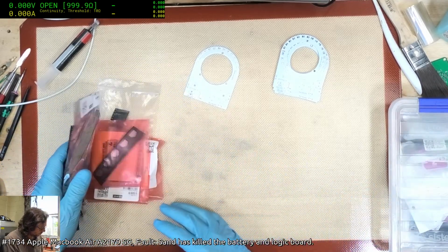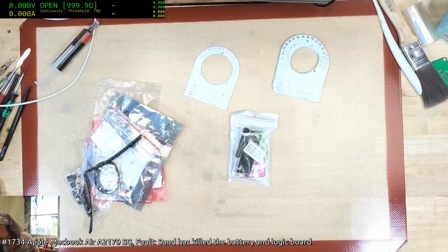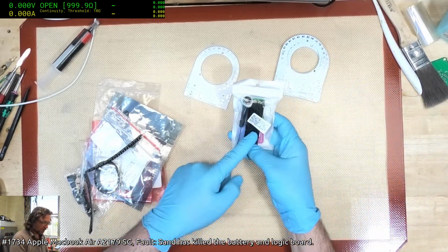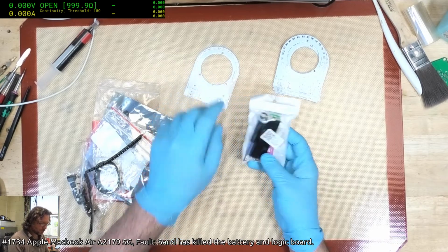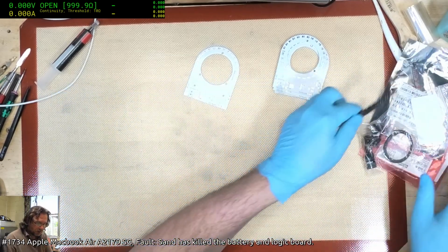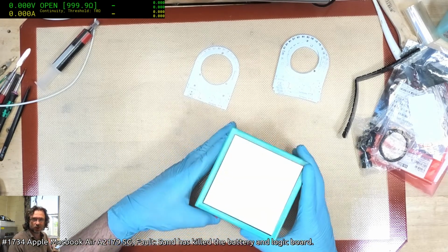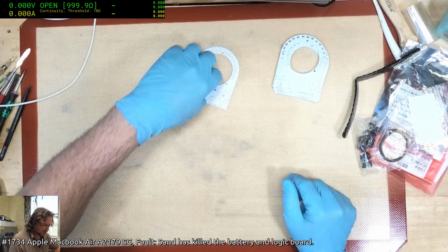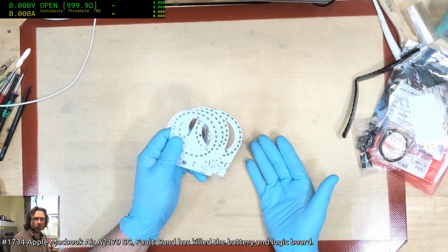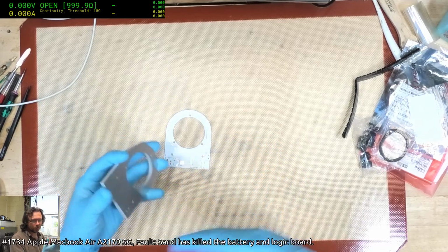Let's see, did I get a... And I've also got these bigger heat sinks that I'm using now. They're actually meant for NVMe drives, SSDs, but I've made the width pretty much the same as for the Microscope Light. They work pretty well. Now obviously for this we are going to use a reflow, a very dodgy reflow, but we're going to do it anyway, and then after the reflow we spend just as much time reworking it. That's the only trouble when you do a dodgy reflow system, you've got to do a lot of rework. So let's get to it. I've only got 5 of these. Obviously when I'm prototyping I only buy the minimum number of boards, and then if the prototype proves itself, then you go and buy the couple of hundred.